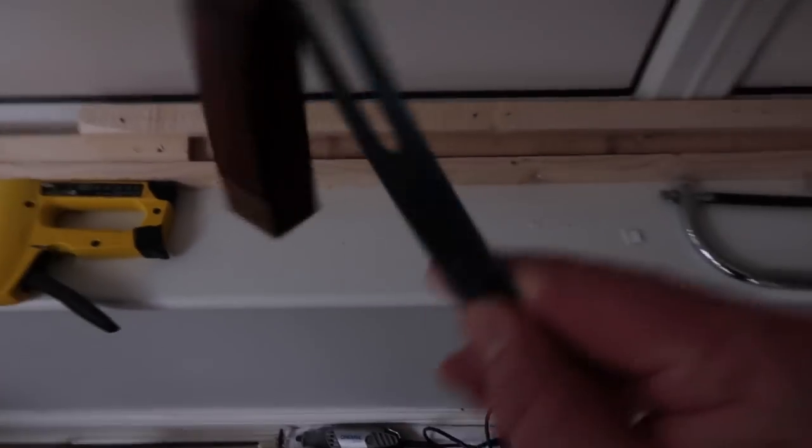I'm joining it all up, putting these last few bits in. Some of it doesn't fit the best - I think that's down to the quality of the cladding, or you need the space to work. What I'm trying to say is just be prepared to go along with it. Another quick tip: I bought this battening from B&Q - don't get it, it's too thin. If you're using the H system you need the wood to be wider so you can staple both sides. It hasn't done the job.